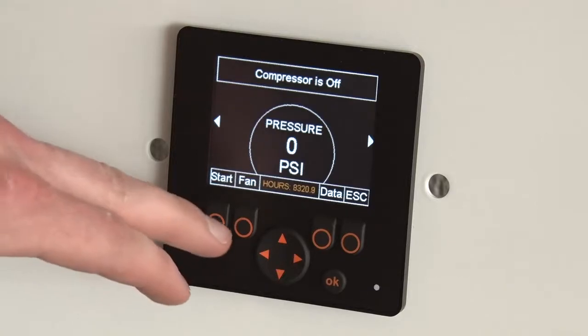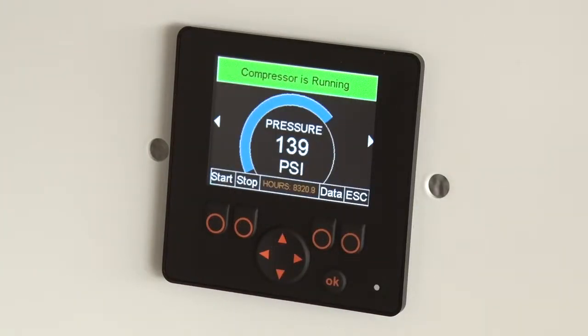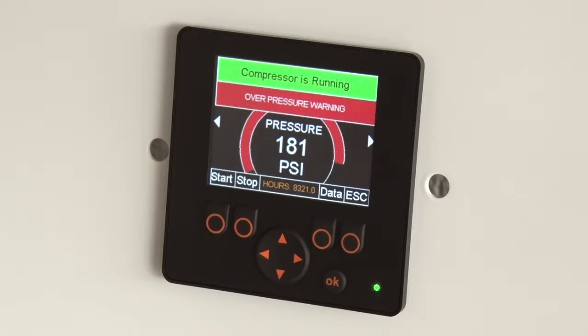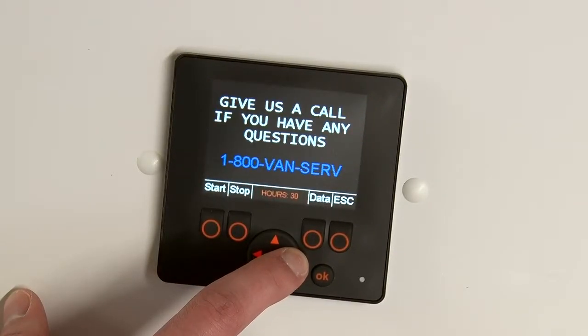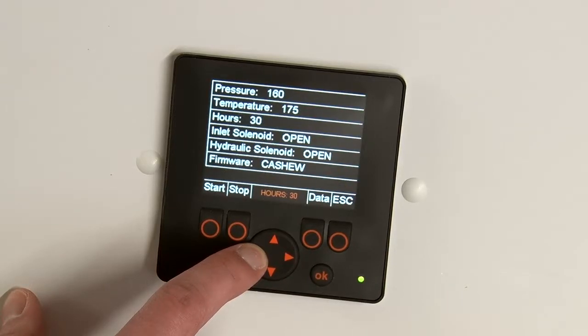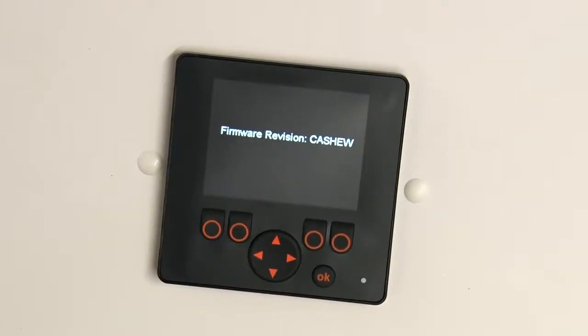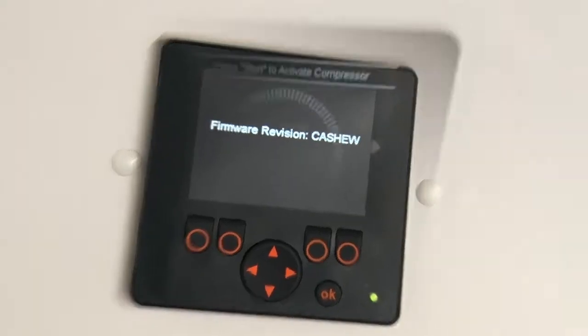The Reliant RS45's controller comes with a number of screen identifications you should be familiar with prior to operating the machine. Use the left and right buttons to navigate from screen to screen. This automatic screen appears when the controller is first initiated. It remains for a few seconds, then changes to the controller revision screen. This screen shows the current version of the display and controller software. It remains for a few seconds, then changes to the main screen.